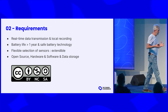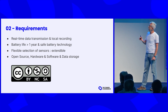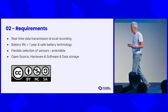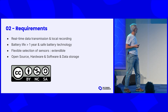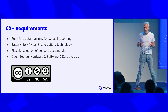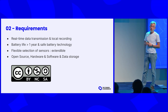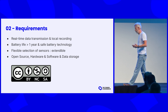It's not just a technical problem; there are a couple of requirements on top of that. We need to do real-time data transmission — that's for the short-term. We also need to do local data recording, mainly because existing solutions already do local recording and the customer wants to keep that feature. We need a battery lifetime of at least a year, and we have to use a safe battery technology, because most lithium batteries are not very safe — that's why you cannot take them on an airplane — and you don't want to put them next to a very high-value piece of art. It needs to be flexible in terms of sensors: temperature, relative humidity, light.